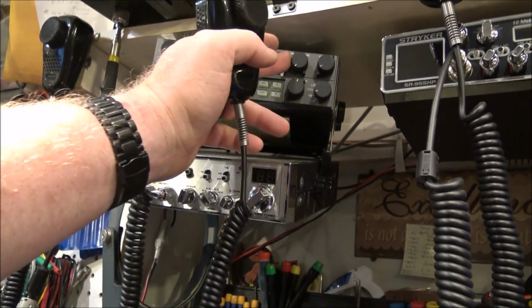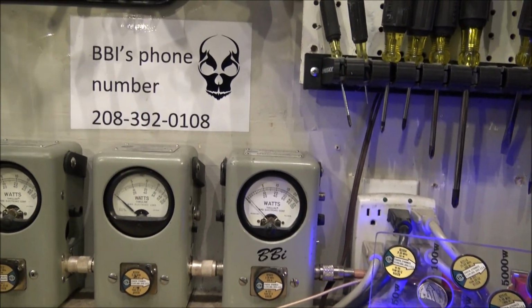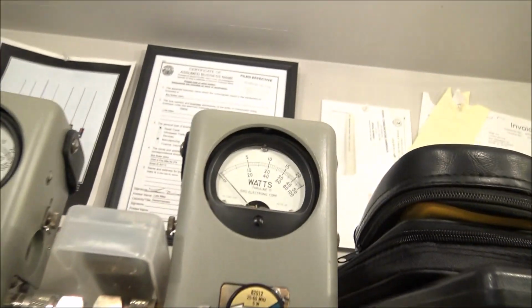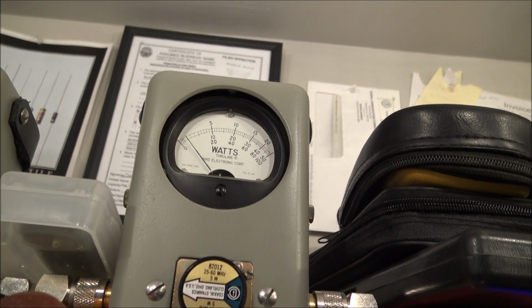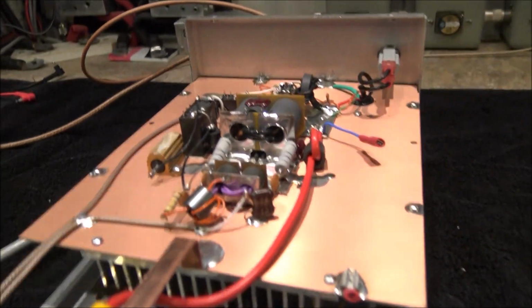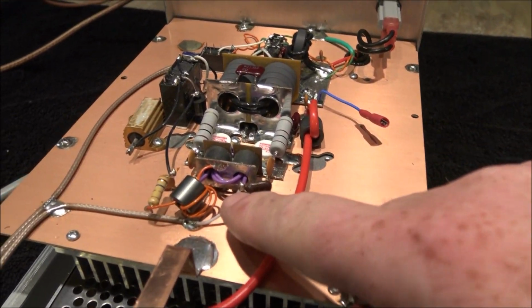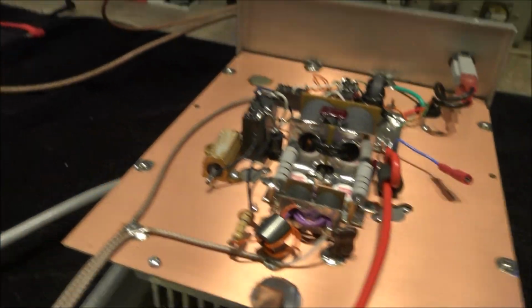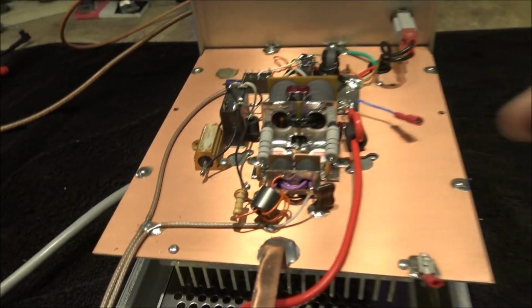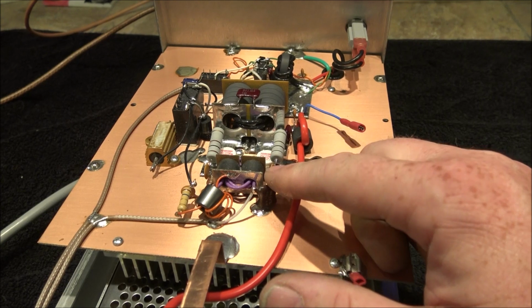Hello. So the dead key all the way up at 5 watts, Spark. Here's down at 1 watt. Hello. 300 peak. Here's your input tune. Hello, hello. And if you notice, we took the input pad out that they add here. I think I already pitched the resistor because I don't care. We changed this capacitor out, got it all nice and balanced out for you.